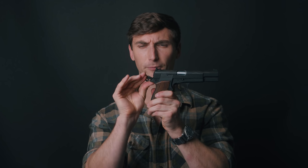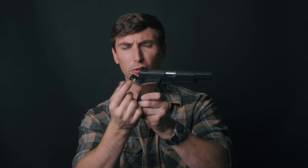Speaking of hammers — on the weapon we're returning, the original one we received, in addition to the finish problems, something was wrong with the hammer. The hammer wasn't quite centered. What was occurring is it began to peel back the metal on the hammer over about 200 rounds — the weirdest thing I've ever seen. I want to chalk it up to a QC issue. I haven't seen other people with that issue on their High Powers, but that was my intro to the SA-35. On the new gun they sent us, however, the hammer is fine — no issues with peeling or anything like that.